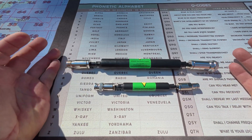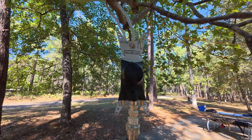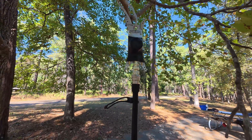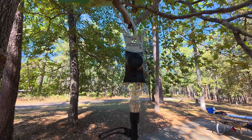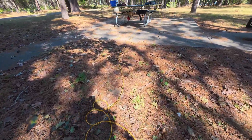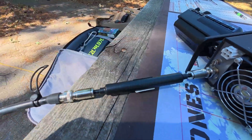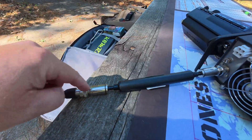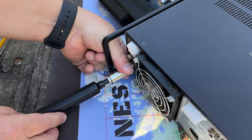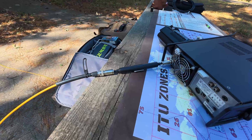Where should you put these on your antenna? Should you put them at the antenna? Should you put them at the radio? The answer is: it depends. Depending on the antenna you're using is going to determine where you put your choke. The most common setup I use is the Pactenna 49-to-1 EFHW half wave — you can see the coax is connected directly to the feed point. I don't use any counterpoise with my EFHW half waves, because my coax is acting as the counterpoise. But I don't want that stuff getting back into my radio, so I put the choke right at the radio. We screw the PL259 into the radio, and then we screw the PL259 from the coax into the SO239 of the choke, and we're good to go.